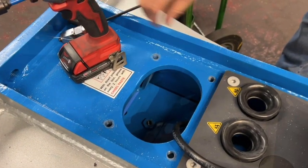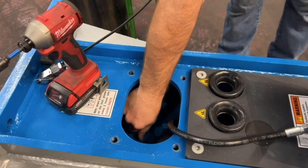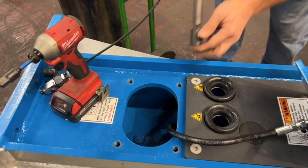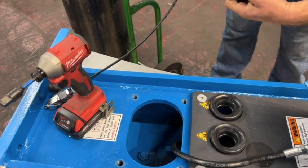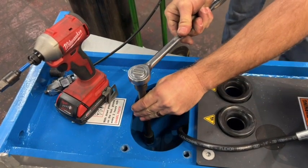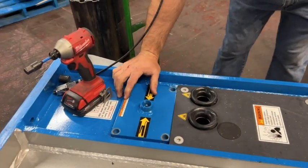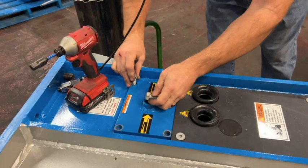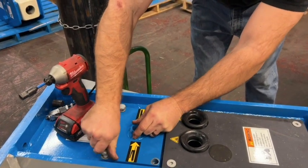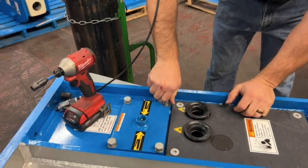Back cap pressure is good. For you guys with the smaller hammers, that's all you need to do. We will check the accumulator next, which is under this cover here. Just put the plug in there - I always recommend hand tightening this plug since it's a small bolt. And while you're in there, it's not a bad idea to look around. Make sure you don't have any loose hoses, hydraulic leaks, grease, stuff like that. It's a good opportunity to check those things.